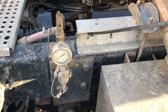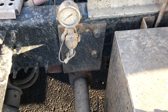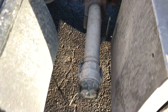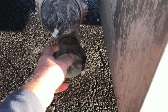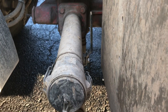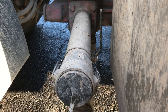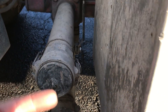On my truck I've got plenty of room so I can hang stuff where I need to. Just to give you my setup — I'm running a Roper pump. The top is the inlet, the bottom is the outlet. When I had the pipes built, I had him also build a bypass so I can make sure the product is flowing. I don't start with the pump on; I start with the bypass on so it just goes in and bypasses — skipping the pump.